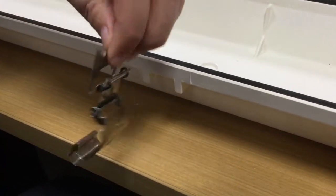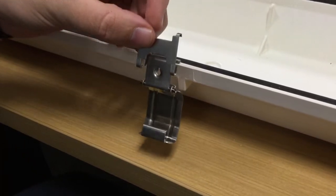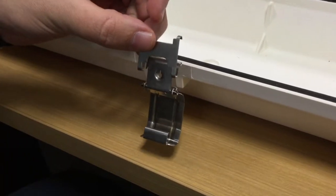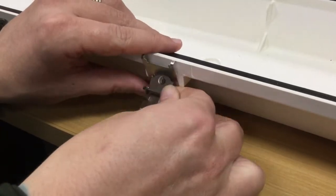This is how to install the SLP Stainless Steel Latch on the Citadel 2 housing. Start with the linkage portion of the latch loosely hanging from the keeper portion. Insert the latch into the latch pockets of the housing.